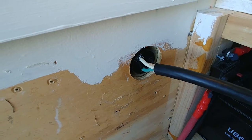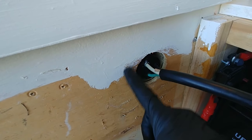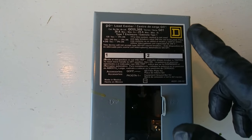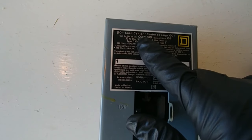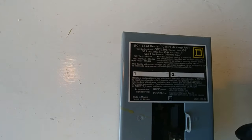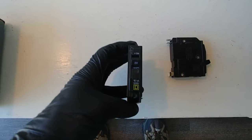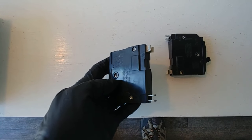This is what it looks like on the inside. The two-inch screws went through the aluminum, through the insulation, and drilled into the three-eighths plywood here. The load center I'm going to be using is a Square D brand, catalog number QO2L30S — it's called a QO load center. These are the QO120 breakers I'm going to use; there are two of them and they're 20-amp breakers.